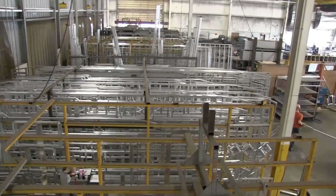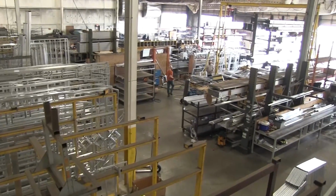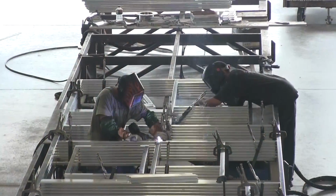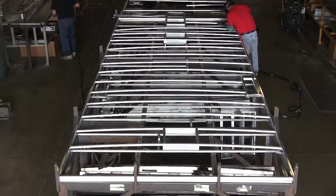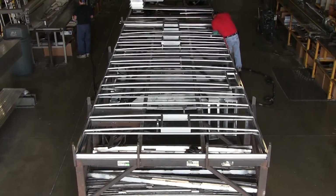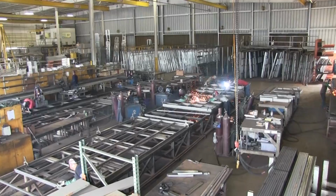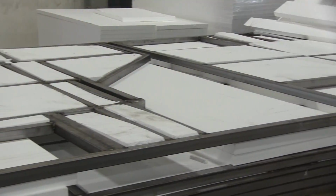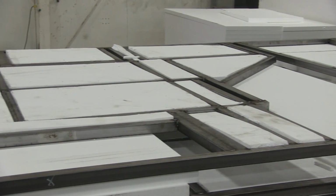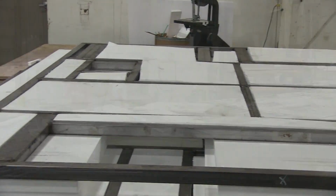All of our motorhomes are engineered using the best combination of aluminum, steel, and fiberglass. The walls and roof are constructed from aluminum, which provides a strong yet lightweight skeleton to support the overall house of the motorhome. Our floors are built from steel. The heavier steel construction helps lower the overall center of gravity of the motorhome, while providing an excellent platform to help insulate the interior of the RV from road noise.